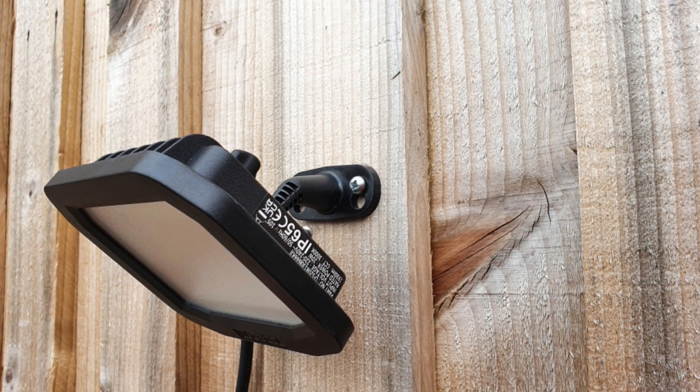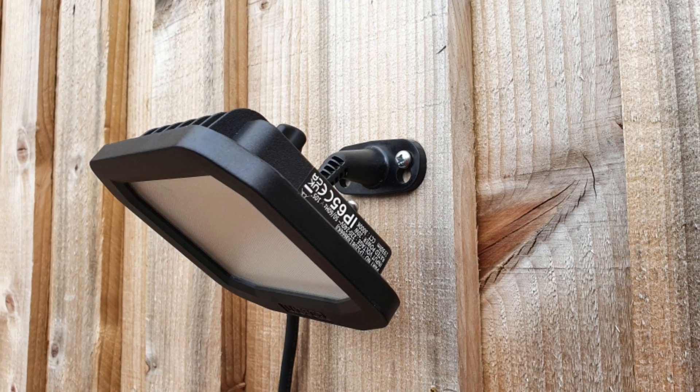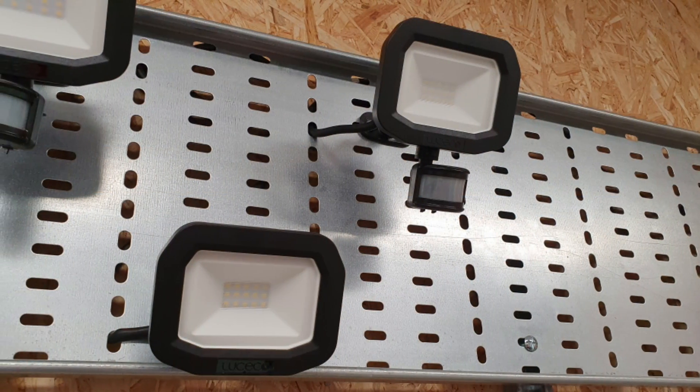And finally, it just looks so much better than the traditional bracket on the back of a flood, lending it a more elegant and refined look once it's been installed. Another major benefit of this fitting is the amount of different options available. The fittings can come with or without PIR, and also in a range of power ratings and lumen outputs: 10 watts giving around 1000 lumens, 20 watts giving around 2000, 30 delivering about 3000, and 50 watts outputting about 5000 lumens — meaning the fittings are delivering around 100 lumens per watt, giving them a really solid rating for efficacy.